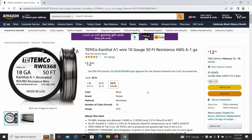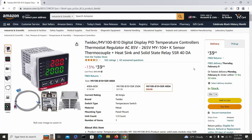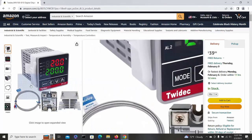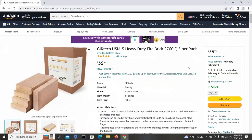I'm on Amazon here. Here's the resistance wire that Jeremy recommended — I'll get 50 feet of that. Here's some furnace cement I've used before and it works pretty well, so I will get a tub of this stuff. Here's the temperature controller that Jeremy recommended — it comes with a thermocouple, a solid state relay, and a heat sink for the solid state relay, so I will get this. I don't have quite enough fire brick to build this thing, so I'm going to get some of these harder ones, which should be good for the base.